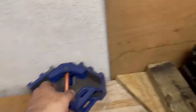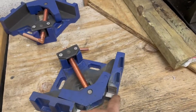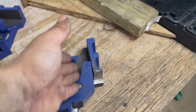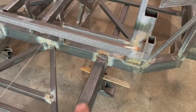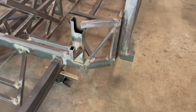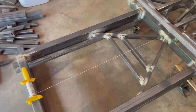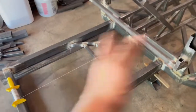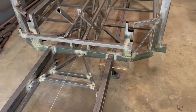I did have to modify my welding squares — I had to cut off a section of them so I could fit the two-by-threes, because I have one that needs to bypass the piece coming in for the front section. I cut off about a quarter inch so I could put it up in here to keep the tubes nice and square as I welded those up. Now they're all square and the dimensions are right from front to front.